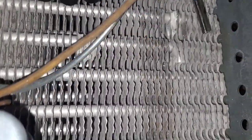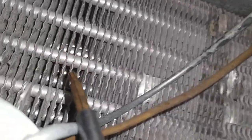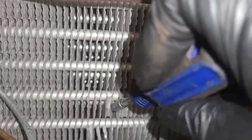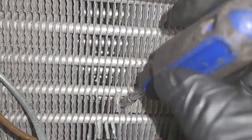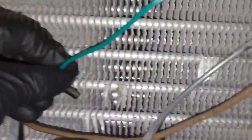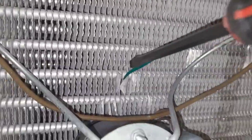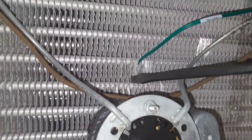Take the new sensor out of the bag and start unpackaging it. I'm going to strip about that much off it and run it right through this hole to mount it in the coil, just like the other one was — but going a little bit deeper. To seat it in the coil, use something that's not too pointy but just pointy enough to go through, going in the direction of the tubing to avoid hitting any copper. Just waller it out a little, then take the sensor and put it in there as deep as it'll go. Then take the fin and close it back on the sensor so it doesn't come out.